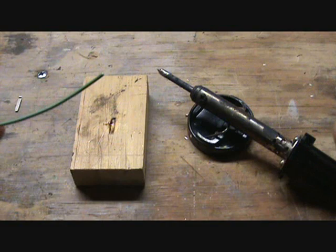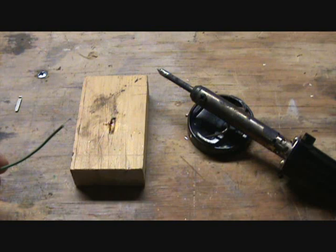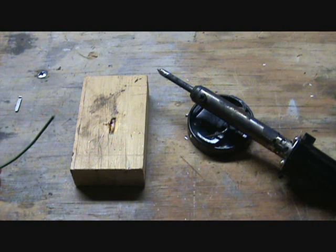If I'm using DC, this would be my primary power line. If I'm using DCC, I may have several of these, because there's data coming to your track. You will need to wire up several different track feeders for your layout to function at maximum performance.